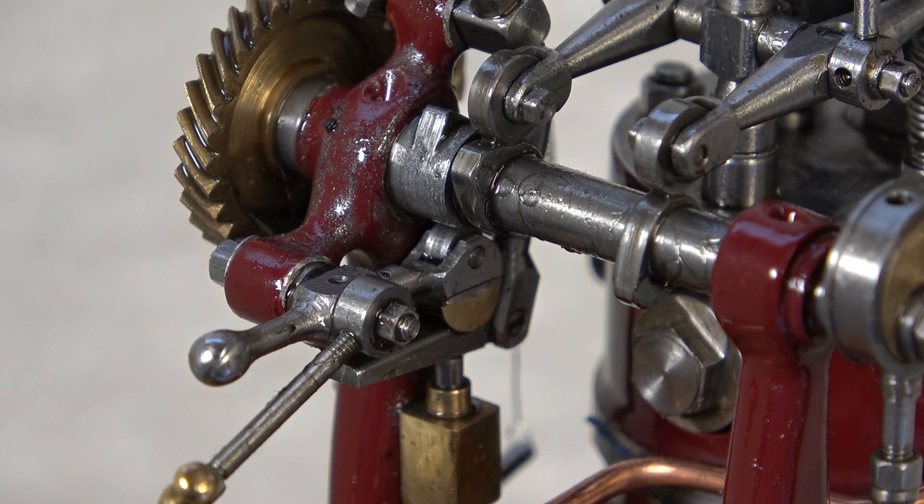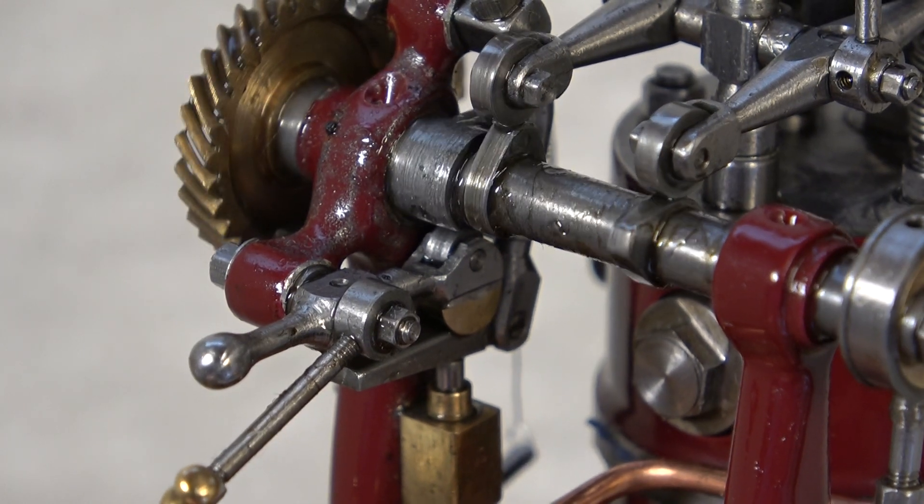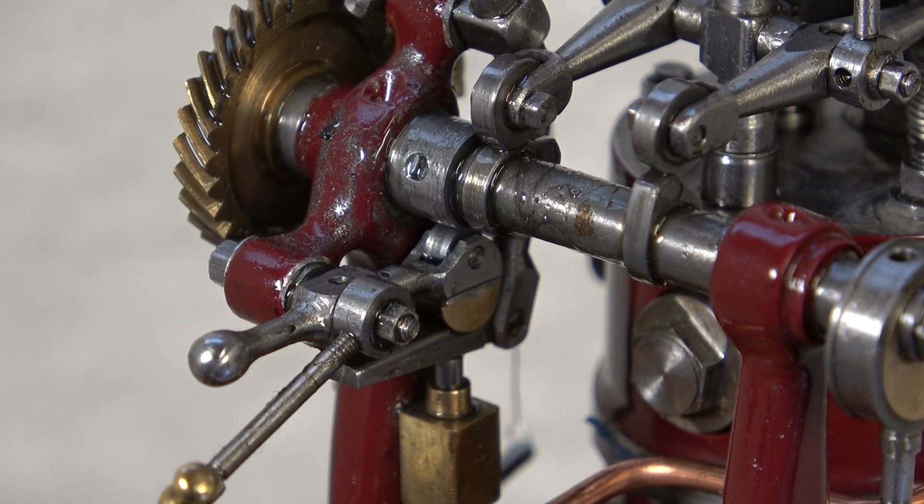Perhaps a thing I should mention: the injection timing must be adjusted when running from diesel to semi-diesel. A diesel engine has the fuel injected at the compression stroke just before top dead center, and a semi-diesel has the fuel injected at the intake stroke sometimes. The exact injection timing point depends on the kind of fuel, the compression ratio, the hot bulb system, and so on. On this engine, it is possible to reduce the injection timing — this is the injection pump cam. It has a set screw to be loosened, and then you adjust the cam to the right injection timing.